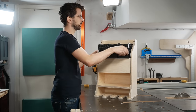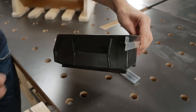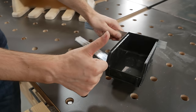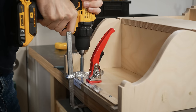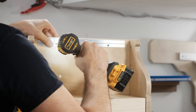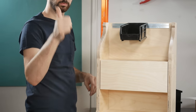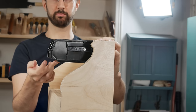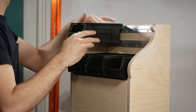These are bins made by Acro Mills, which is kind of an industry standard. They have a hook on the back that typically fits into a panel they sell, but that panel is way too big for my needs. I found these cleats meant to hang heavy picture frames - the 12-inch ones were the perfect size so I didn't have to cut them. I pre-drilled them with a self-centering bit and screwed them into position. There was a problem though: the thickness of the hook wouldn't fit between the cleat and back panel. The solution was simple - just a couple of washers in between, and that allowed it to fit right in. After installing the second row, I noticed the bin wasn't level - in the Acro Mills system, the hooks on their panels are spaced twice as close together, which allows the bottom hook to level out the bin.